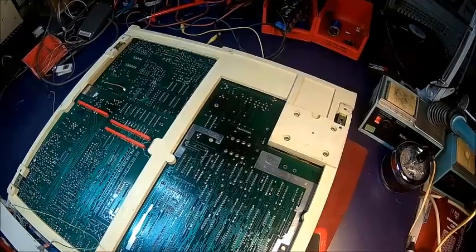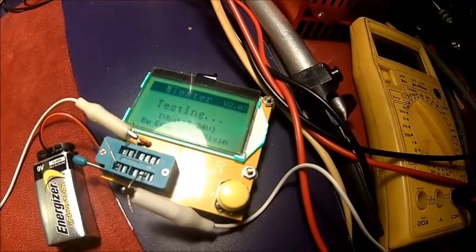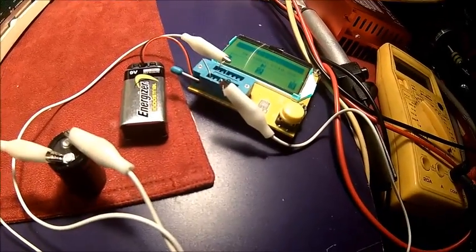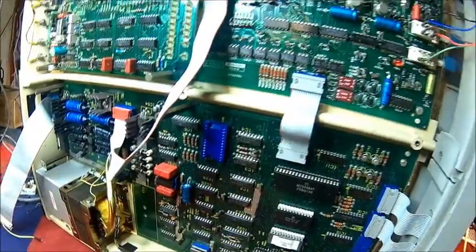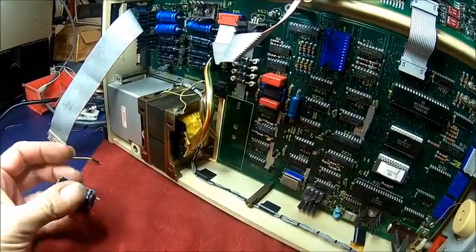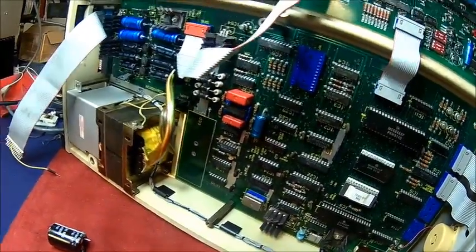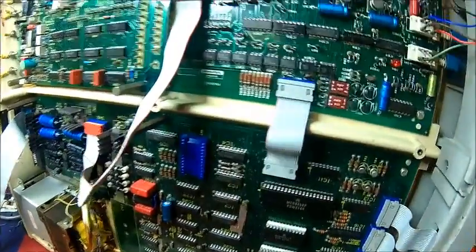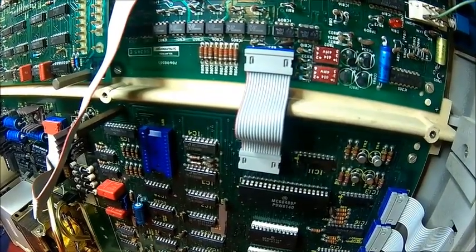Let's pull that capacitor. It's interesting — it tests as a diode with 160 millivolts, and it's a 10,000 microfarad capacitor. I think the ESR is fantastic actually. I get the feeling it takes ages to charge. This capacitor is from 2001 — I might have changed it already, because there was a much bigger one in there originally. But all the other chips are date-coded from around 1981, so this unit was probably made in '81 or '82.